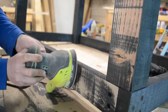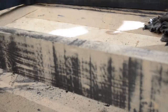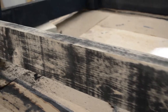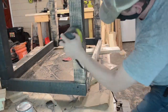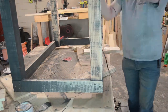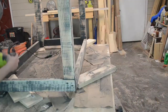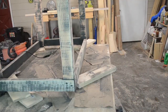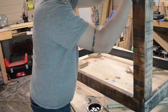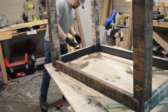The goal is to leave darker areas in the saw marks to give it that rustic sawmill effect. I went over it one more time and cleaned it up a little bit more — you can see me finishing it up in super high speed. This was actually day three of working on the table due to the temperature. After that, I went back with a medium stain — I think I used Minwax Special Walnut — just to fill it in across the whole table.